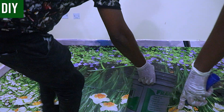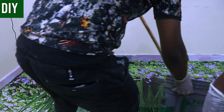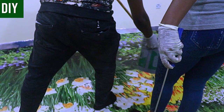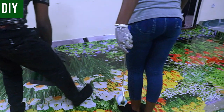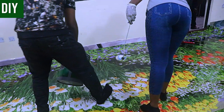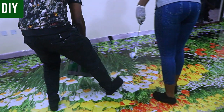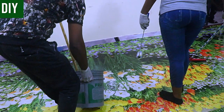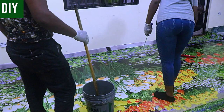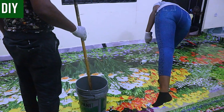When installing your SAV, use a neat and very clean napkin. Notice that everyone working on this project is wearing a clean pair of socks. Epoxy has a way of distributing stains — if you come onto the surface with bare feet or dirty socks, and stains from your feet or socks get onto the SAV during installation, you won't notice them right away. But the moment you pour your final coat — the FSC 900 — upon the SAV, the epoxy-based chemical will take those stains and spread them all over the floor.